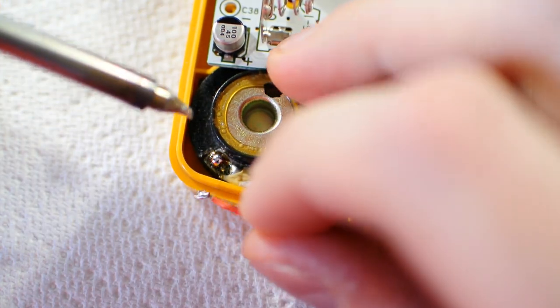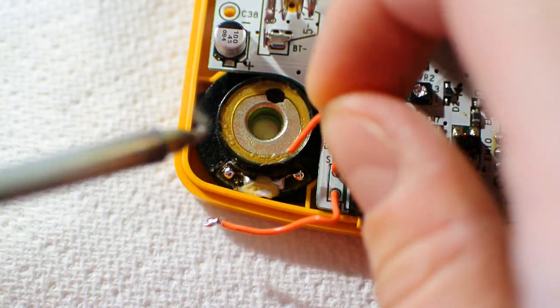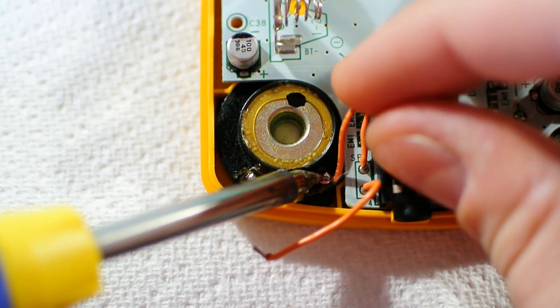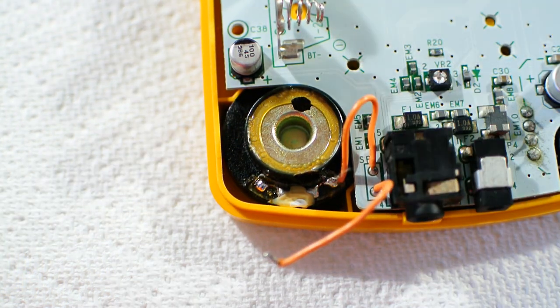This part involves a little bit of soldering, but it's very straightforward and easy. All you need to do is disassemble your donor Game Boy Color, desolder the wires from the speaker itself — it's easier to desolder them from the speaker than from the logic board. Take the old speaker out, desolder the defective speaker, and then solder the replacement one in its place. Just a couple of minutes. You don't need a fancy soldering iron, and sometimes you won't even need any spare solder. When you're done, you should end up with a Game Boy Color that works and sounds great.